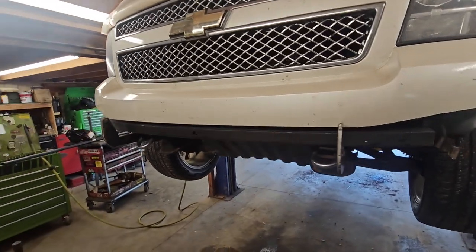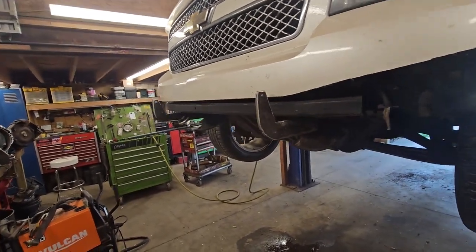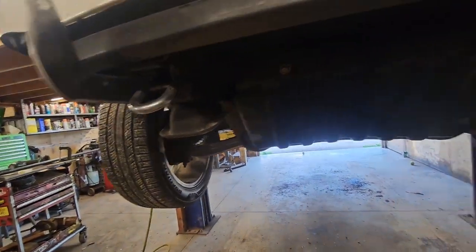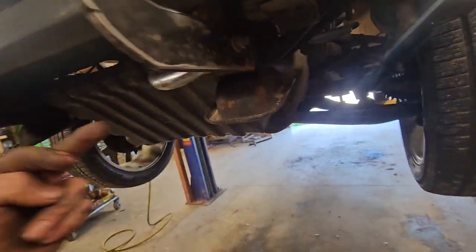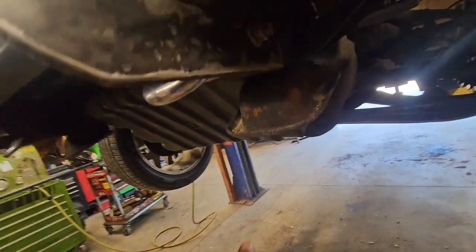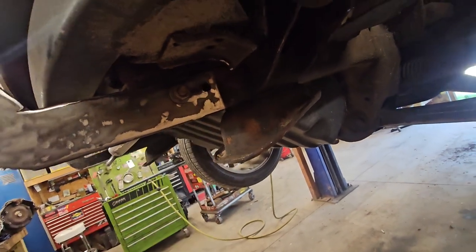Alright, so a couple fang tooths coming off of her now. I guess that's just the style it's going to be. So I'm digging it, but we're coming off these recovery points here, and so just bolted through the same as those, but they come through this way, the bolts for both of them. They're both manufactured the same, so I'll have to end up drilling a hole back here for this one when it's all done and put a bolt there.